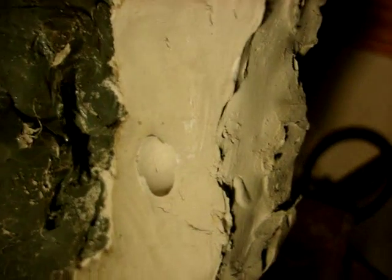Right now, when you take out the clay walls, it will make some jagged edges, somewhere like this. It's dangerous. So what you can do is take a hammer or a chisel, and you can use the end of the chisel to do that, and then it will break it down.